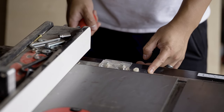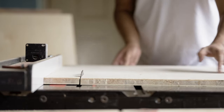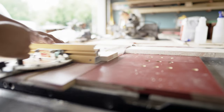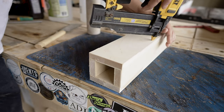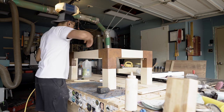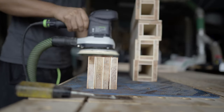The size of the coffee table is based on the size of our living room. We don't have that big of a living room — we want to still have plenty of space for our son to play. So this coffee table won't be really big, but it'll be perfect for our needs. After measuring the size of our couch, I felt like a 32 by 24 coffee table would be perfect. I'm building up the legs using plywood to create essentially a box. I'll use the same plywood for the aprons as well as the top. Once I got all the pieces cut out, I can do a quick mock-up with all the brackets attached, and once everything looks good I can go ahead and give it a good sanding.